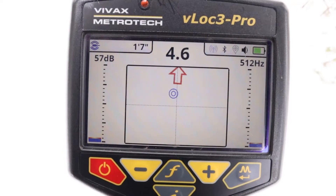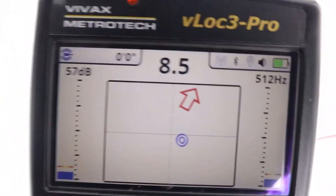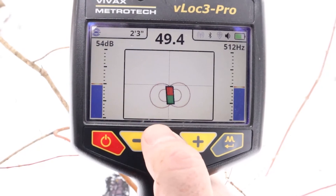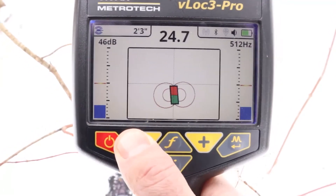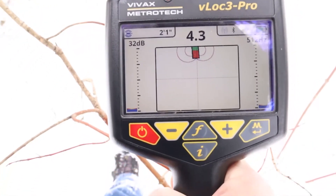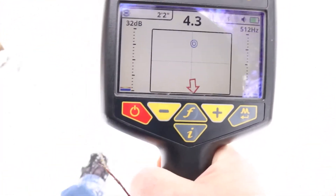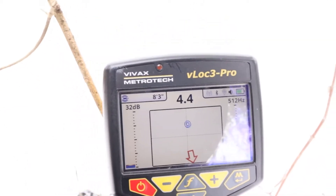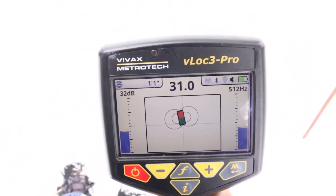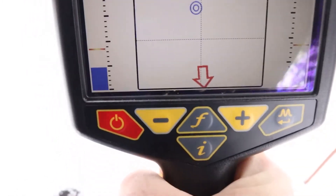My arrow is locking in and I've got my ghost signal coming up on screen — those are the little blue rings. Got some bushes to get around. My bars have come up and I'm actually right over top of my sonde. It's not very deep — from where I'm holding the receiver, it's 2 foot 3 inches down. I can lower these bars on screen. What I'm looking at is my red and green of my sonde, which is right beneath me. As I tip the receiver back and forth you can see it moves. If I go past it, you can see the ghost signal ahead and the arrow telling me to back up. That sonde is just behind the actual camera head.